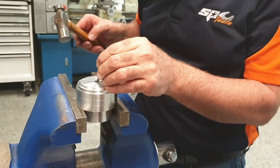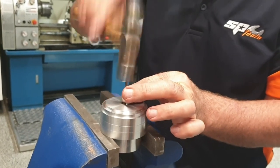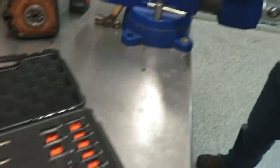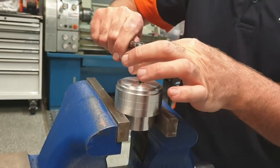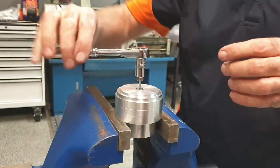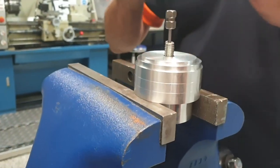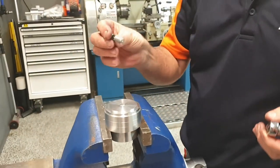After completing the hole through the bolt, we drive the driver rod into the stud until we're sure it's at least through, then we select the driver, put the driver nut onto the rod, and again gently apply pressure — and there she comes, excellent. That's a good sign because it coming out means the thread is not badly damaged. If the thread was badly damaged, we would run a tap through it to clean it out, but in this case it looks pretty right.